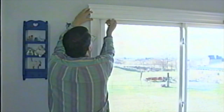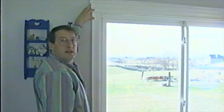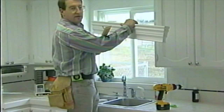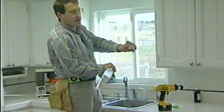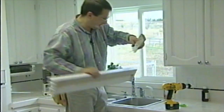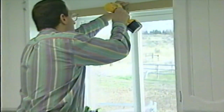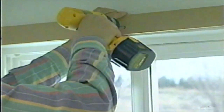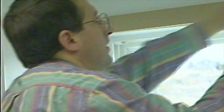You could put it at a height to hide your mini blind, or if you're going with draperies or some other window covering, go ahead and install it at the top. On this kitchen window there's no room for side casings, so a different version of this product is used with a mounting strip where the back has a recess cut in to match. You just screw the strip on — it's also great if you don't own the home you live in. You could put these up with screws, and when you move, you can take them with you.